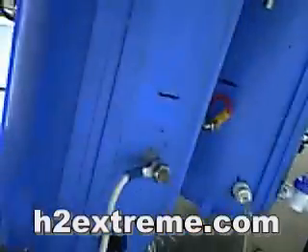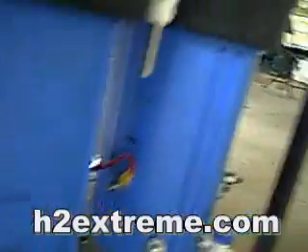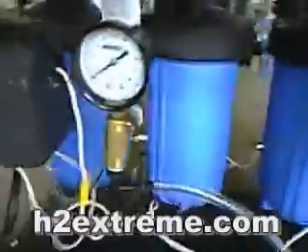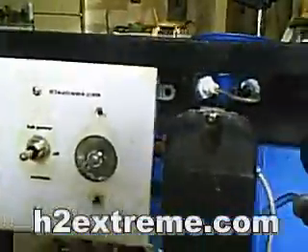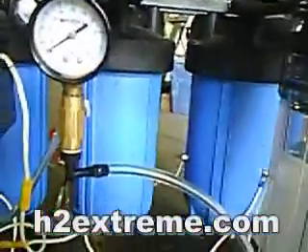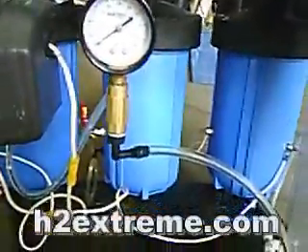Got three of these containers and they can't handle the pressure. I push it all the way to 50 psi, and it will make approximately eight liters a minute of HHO gas — about four to five liters a minute on a constant rate. What I want to do is design a cooling system so I can run it at eight liters per minute constant.